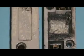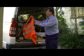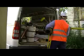Small package boards are one of many components containing asbestos found within switchboards. Licensed electricians need to take care to avoid exposure to asbestos fibres when changing older style small package boards that may have an asbestos backing fixed to the mounting board.